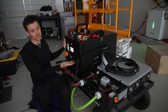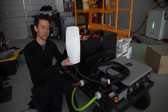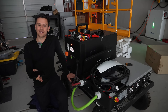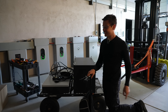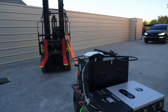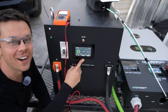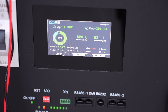I don't know what else to test — it has the same BMS and new cells. I took out the 18K PV because I hate the settings on that; the 12,000 XP is much easier to set up and will almost max out the output. It's hard to test these batteries because no one has a load large enough: 48 volts times 240 is 11,520 watts. We're still not maxing out the inverter, but it will max out the battery. We've got power — let's go charge it up. We're pulling 201 amps. Finally able to load test this BMS. We're going to run it to zero, so this will be an awesome test.